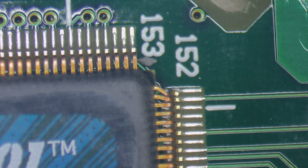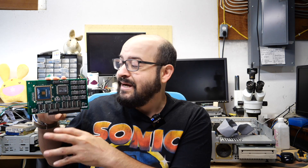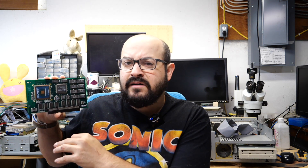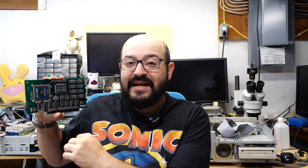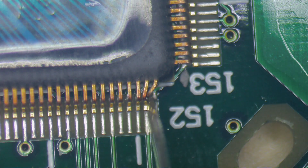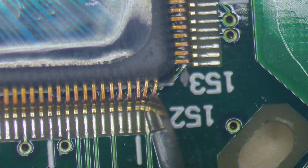When I looked at this thing under the microscope, I noticed those bent pins weren't really adhering to the solder. I don't know if it was just old solder or the solder paste was now decaying, but they weren't making a good connection and those legs were just wiggling freely, not touching anything on the board. The processor legs where they were bent had been bent enough to break them off of the solder. So I had to fix that.